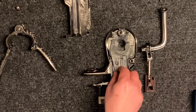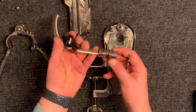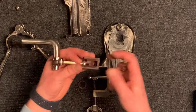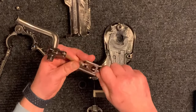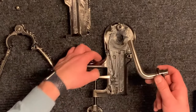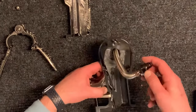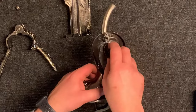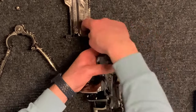Make sure the cam is fitted onto the post. The large bushing will need to slide all the way back up the arm before inserting the arm back into the body. The drive slug needs to be fitted into the groove on the body.